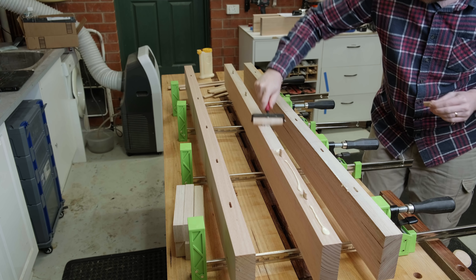While some parts get flipped to receive the second row of mortises, the mortises in the face need to have the fence adjusted. For sanding, I use the pencil scribble method: lightly scribble all over the piece with a HB pencil, then when it's all sanded off you know you've sanded enough and can move on to the next grit. After sanding, a light round over is added to all the pieces. My sister wanted to retain the sharp edge look, but I managed to convince her a round over was a good idea for her toddler.